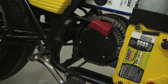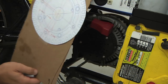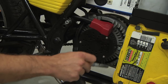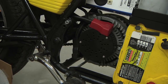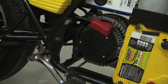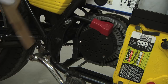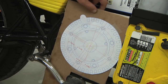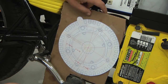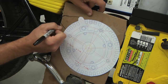Here and here will make great attachment points, and that'll keep the motor from being able to rotate this way. But it's still going to be able to move this way a bit, and we really need a mounting point around here somewhere — there's no good spot on the frame for it. So instead we'll make a third attachment point that goes to the rail of the battery rack. A quick snip of the scissors lets me fit the template in here and mark where we've got those attachment points.